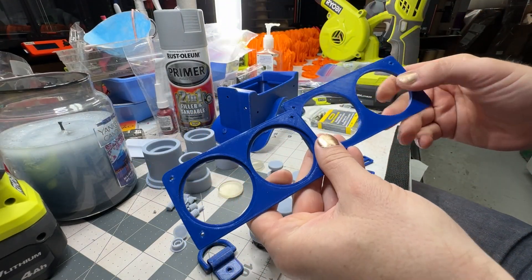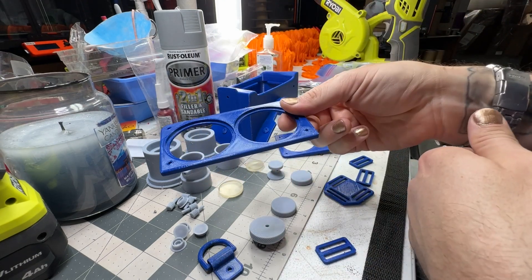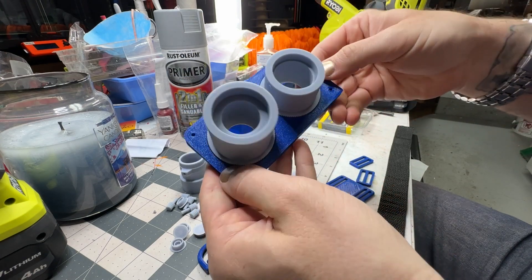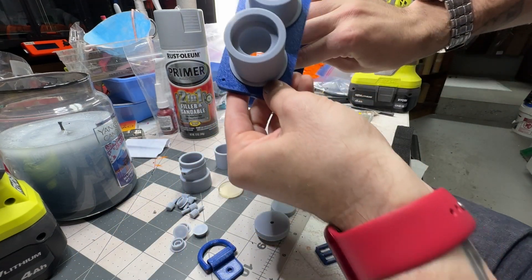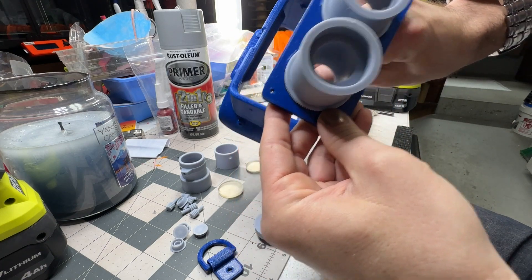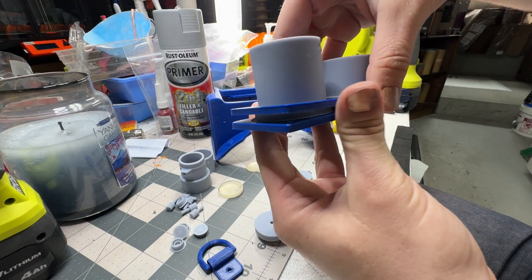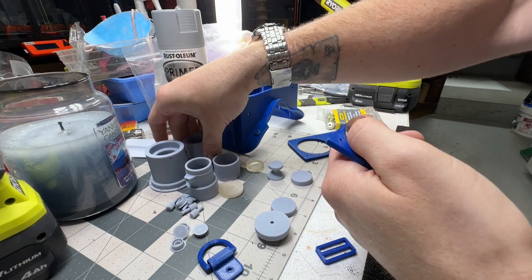These plates — I usually use 8-32 socket head screws in the four corners. You've got this plate with a little edge and these fit in nice and snug. Then you put this one sandwiched on top, so it sandwiches them together with the four screws and holds it together as one piece. Then all you have to do is press fit this into the frame and it'll sit on these little ledges. Make sure you sand it well and test fit everything before you paint. If your lens breaks, you can always press fit this out, take the screws out, and fix or replace the lens — as opposed to gluing it all together, which makes it harder to fix.